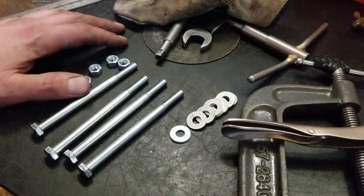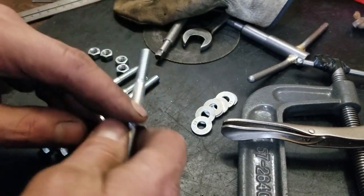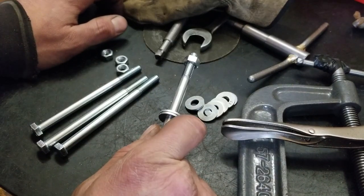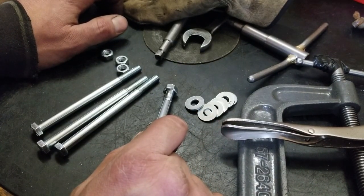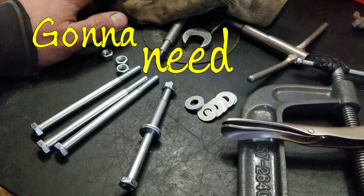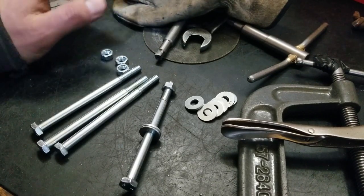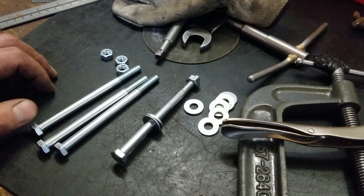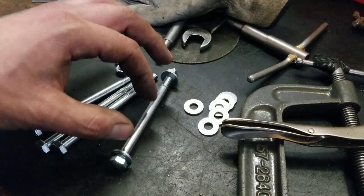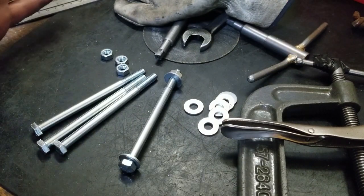In spite of all the trials and tribulations, the pan turned out not too bad — it'll do the job. These are the bolts I plan on using for bolting that sucker down. I kind of want the lathe on there before I drill the holes, just to make damn sure it all goes on there properly. I was going to drill it out just a scotch oversized anyway — hence the washers. As long as it's holding down to the bench really good and going through the top of the table, plus another stud underneath yet.